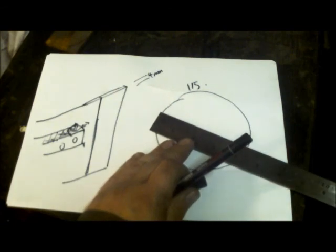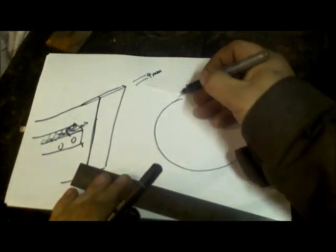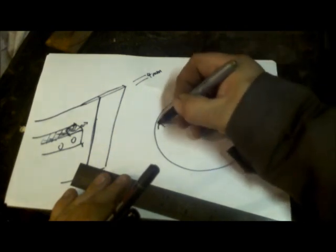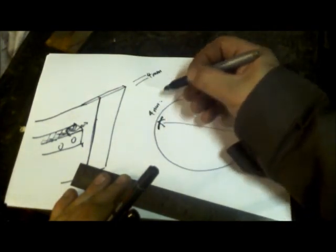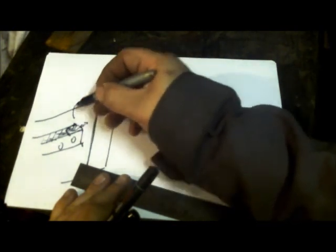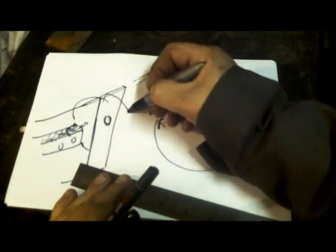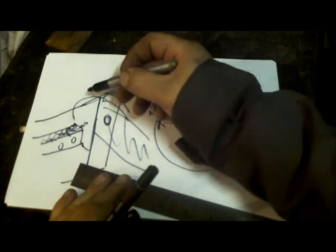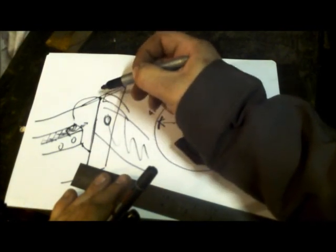That's how close I am. I'm scary, aren't I? It's 110, all right? So 115 mil across there. You only need to get that disc into the cut about 4 millimeters. If you plunge that disc right through and out the side, so it's like this, there's your guard on your machine, and there's your grinder coming down like this, you're only cutting here and here.